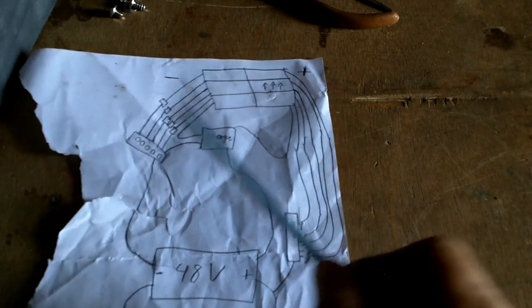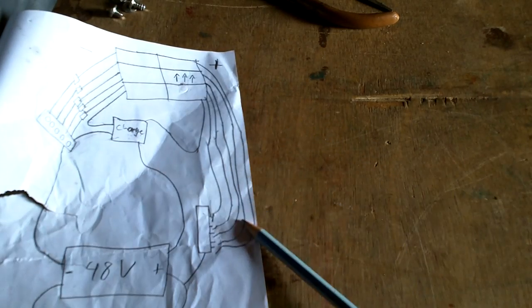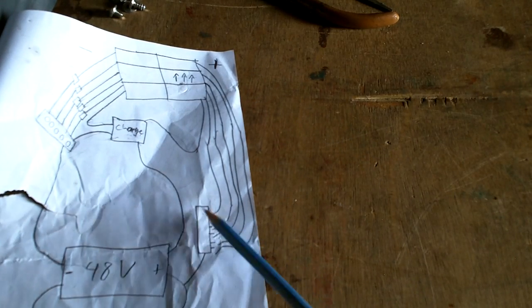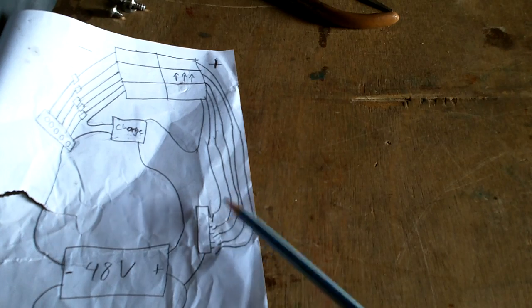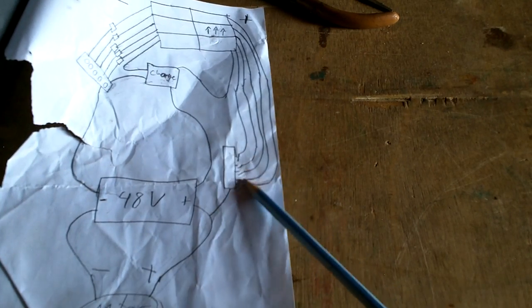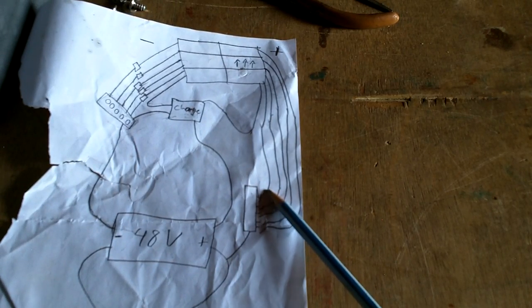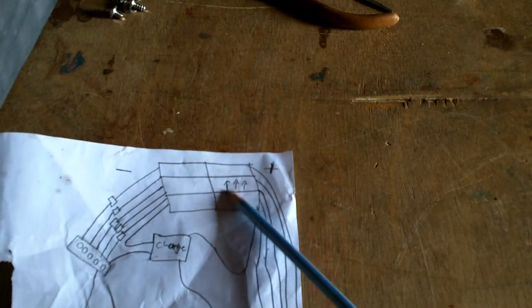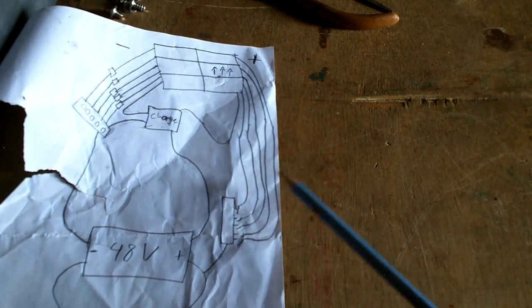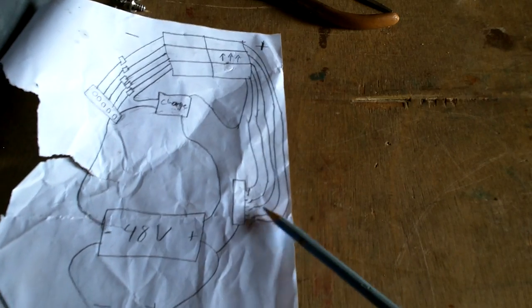But those won't usually do anything because the positive leads from all those solar panels that are not charging the batteries are going to have switches. So I can turn them off and on, so they're not always connected to the battery. Now these shouldn't be high enough voltage to overcharge the battery, which is why I have that other glass solar panel in there. But just in case, I'm still going to disconnect them when I'm not using the motor.